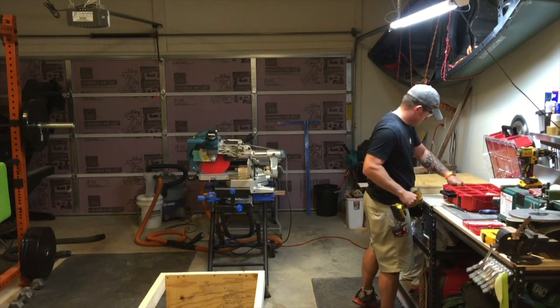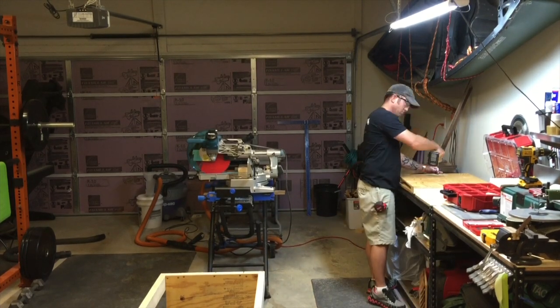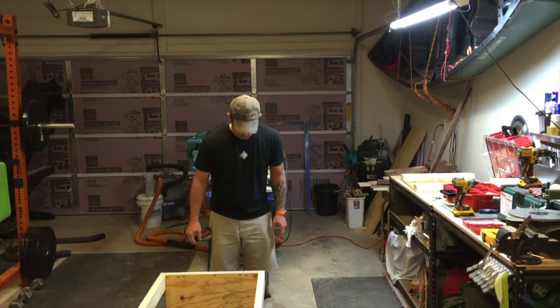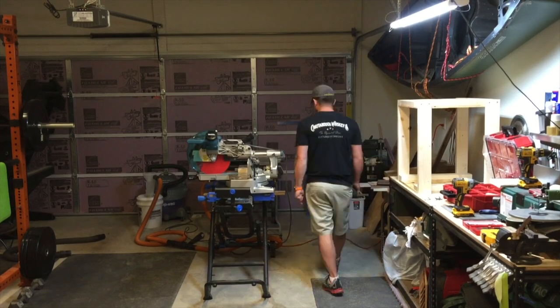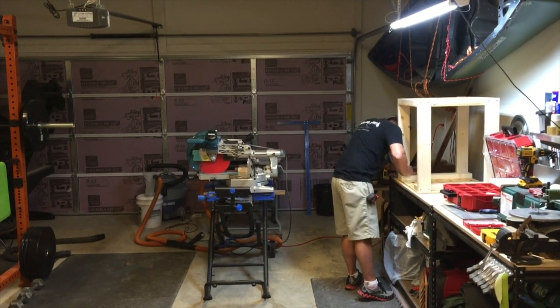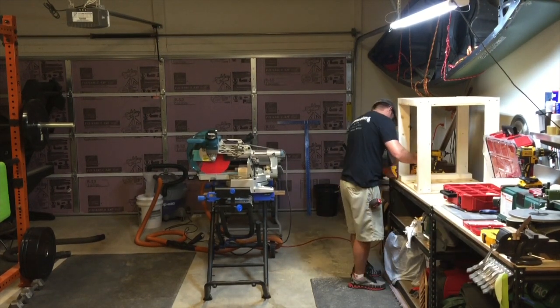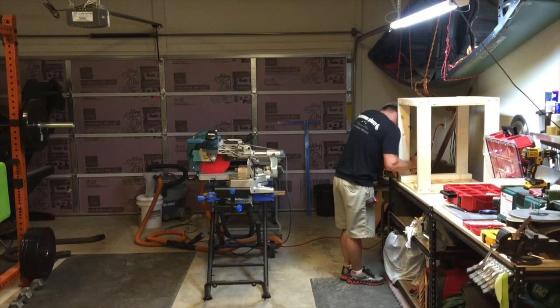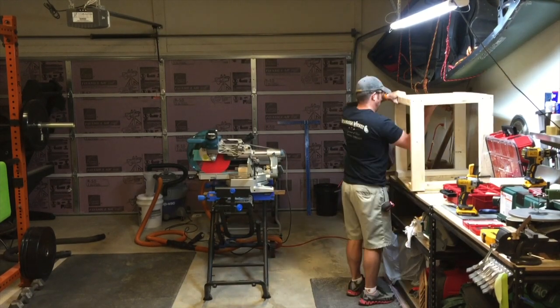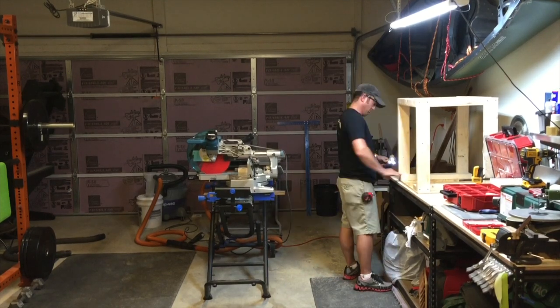So here I'm laying out the top of the cart, the same as the bottom, just adding two 2x4s to the bottom of the plywood. And then I'll attach the top with it upside down here, of course. And you see, voila, look, I forgot the pre-drill holes. And it split, and I'm gluing it up, clamping it, so that I can come back and re-drill that when it dries. So then I pre-drill the rest of the holes, so that doesn't happen again.